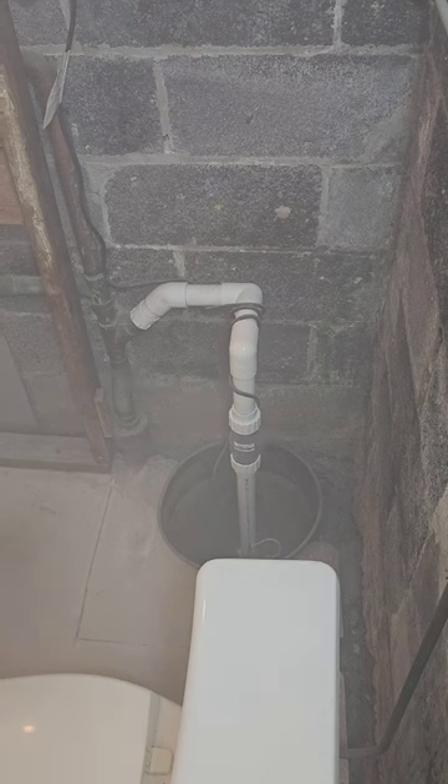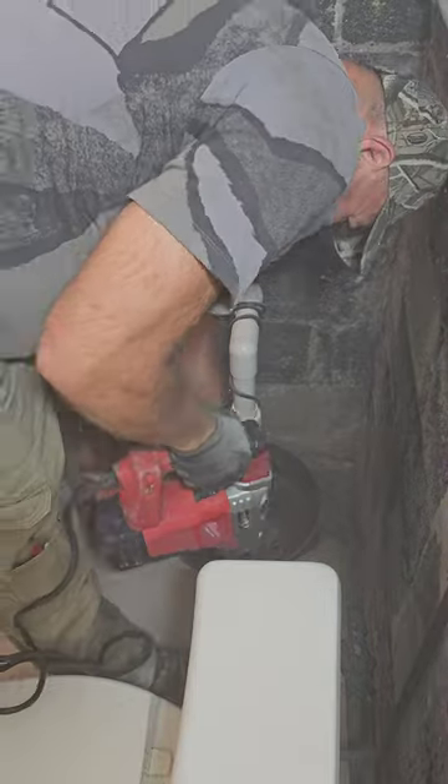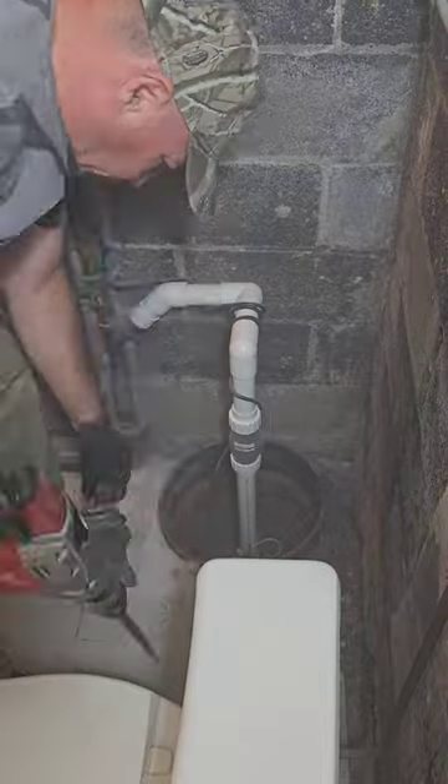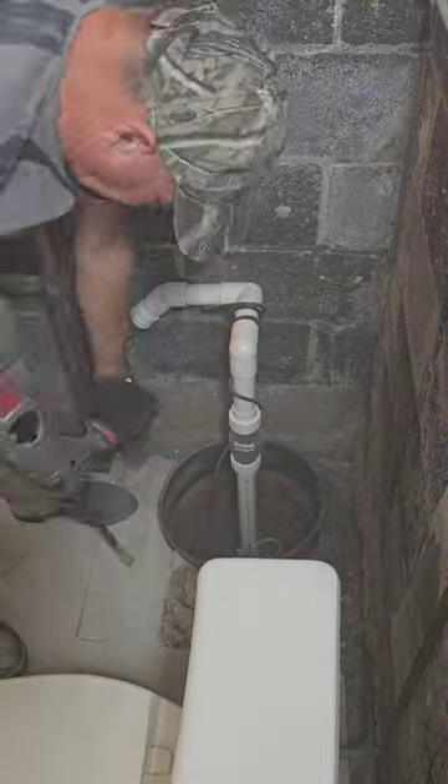So we're cutting out the concrete here, we're gonna chip it out — he's probably gonna get the chipper in a few. We're gonna remove this sump pump pit, which is a real thin metal, it's all corroded. The customer's complaining about a lot of dirt getting inside; obviously there's a big hole in the pit.